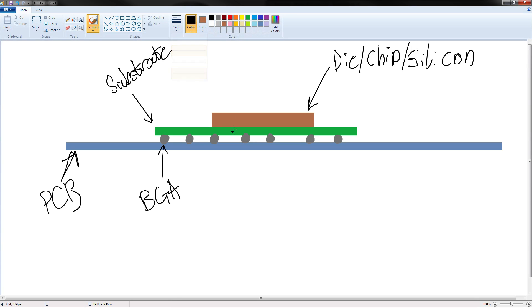There is another technology: FCBGA. FCBGA connects the actual GPU die to our substrate, and this uses what is known as an underfill — which I'm drawing as black stuff here. This black stuff is an underfill. It's basically a bunch of material. What's important is its function, which is basically to hold the chip in place. The chip then connects to the substrate with some connections — these can be soldered, some of them have been done in gold. There are a lot of different versions of FCBGA being used, but let's just say they're made of lead. FCBGA is very, very, very prone to thermal stress.